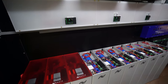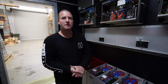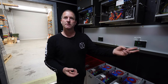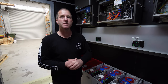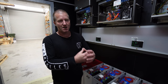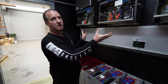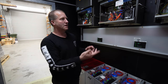Right, so the customer had two phase, you're giving them three phase and more capacity. We're actually giving them five phase power, which is phase A and phase B, which is the two SWER line phases. They're 180 degrees apart, and we're returning them to them as usable AC supplies. And then we're using those two inverters to charge a DC bus and a battery bank, our own battery bank here, which we'll show you in a moment. And then we're reforming three phase on site.